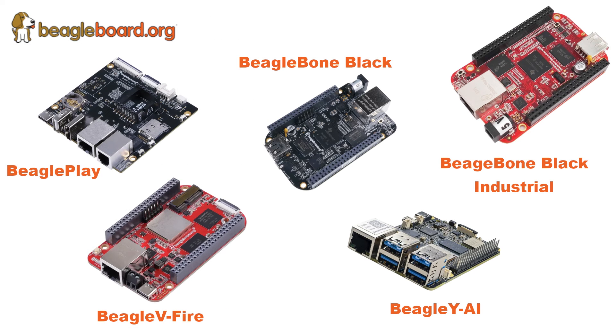Overall, the Beagle Play board and the whole family of BeagleBone systems are very easy to work with and have quite a following. One advantage is that parts are generally available, as opposed to something like a Raspberry Pi where in smaller quantities you'd have to use the Raspberry Pi Compute Module. The TI chips are generally available so you can design them directly onto your board, and the layouts for BeagleBone boards like the Beagle Play are available as a starting point. Thanks for watching Kit Close-Up.